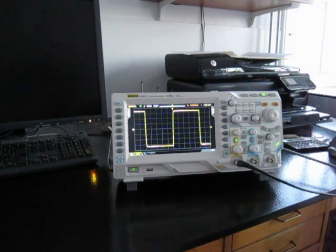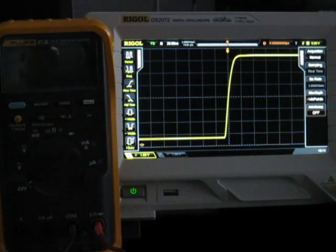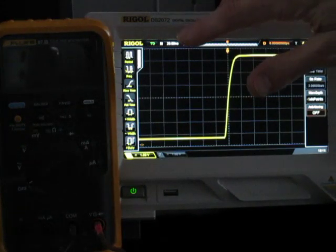We're going to send a 1 megahertz signal in, and we're going to read the output of the trigger out on a frequency counter. According to the material I've seen on waveform update rates, it appears that every model of DSO has a kind of sweet spot, the sort of optimum or best case setting for the time base where it can capture the most waveforms per second. So I've been playing around with the Rigol DS2072, and it seems to me that its sweet spot setting for the time base is 20 nanoseconds.